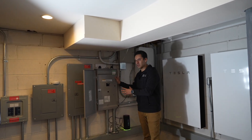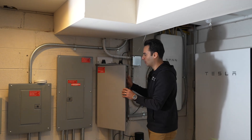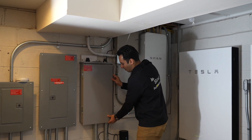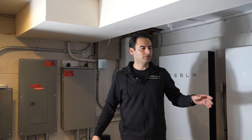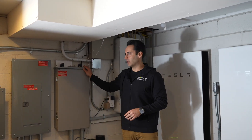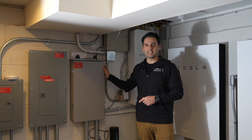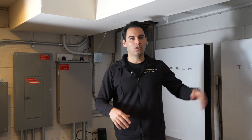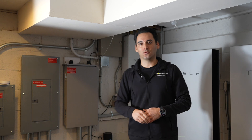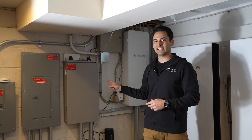I showed you this because we actually have to upgrade this Gateway. Due to the amount of solar panels we have and the amount of Powerwalls we have, it's best to upgrade it because there are internal components that need to be upgraded to be adequate for the addition of the fourth Powerwall, as well as the extra solar we added to the roof. There's going to be a separate video on the installation of the Tesla Gateway 2.